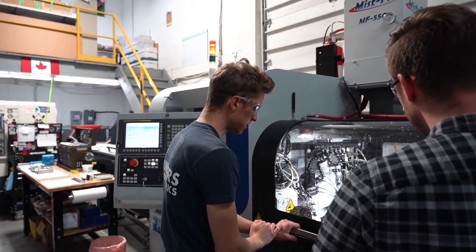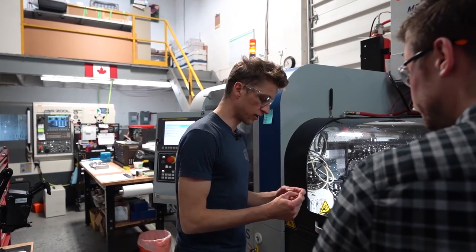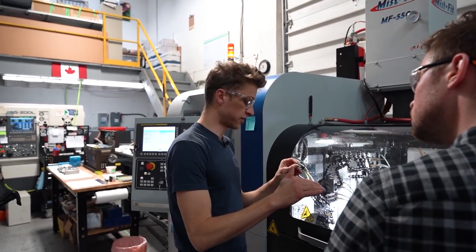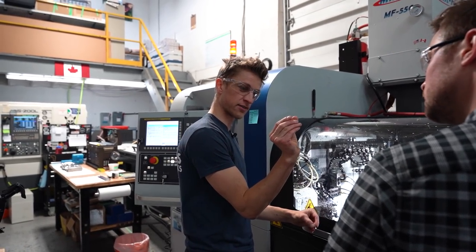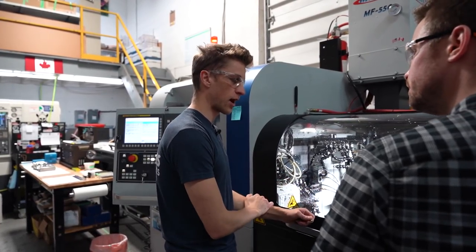And okay. Some materials, like when I'm making those buttons, yeah. They're very stringy. Because I'm doing a really heavy cut. This starts out as like 3/8 material. So I'm making a single pass. Like the depth of cut is about that deep. And the chips really bird's nest and wrap around and stuff.